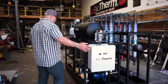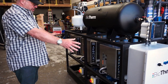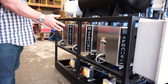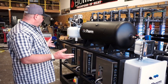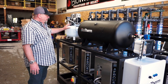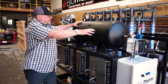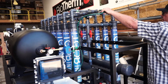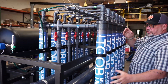We've got a big skid here with an onboard oxygen concentrator, so we're making the oxygen out of the local atmosphere — making very pure, 94% pure oxygen. Then we pressurize it to go into this holding tank to then feed at a higher pressure the manifold on top of this array of infusers or tube infusers.